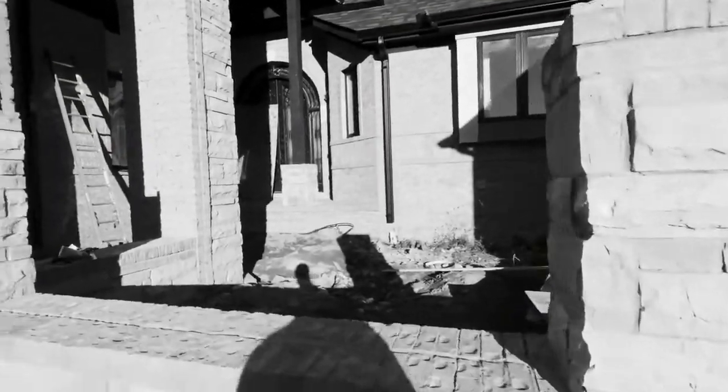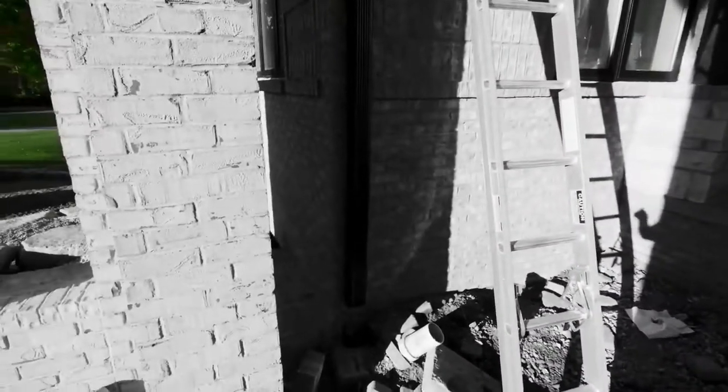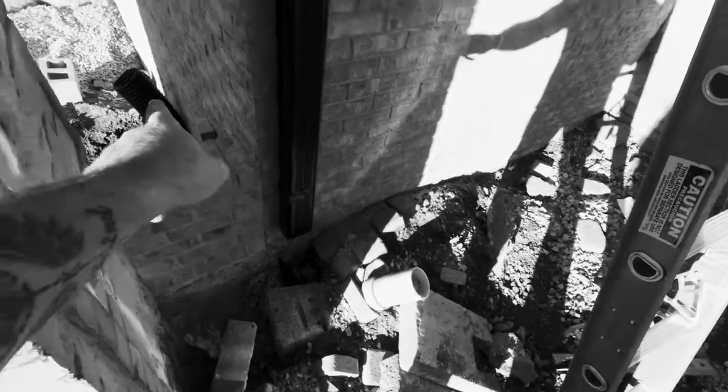So we've got to take that gutter right there, and it snuck around the corner here, it's tricky, this gutter right here. First of all, we have to trench by hand all the way across to here. Then we've got to dig this down far enough that we can bore through the footer to tie into that pipe. Oh boy, that's going to be a blast. So that's probably at least an hour of work with the Hilti just going to town. We'll get some footage of it.